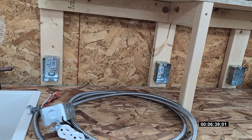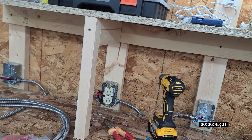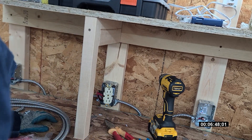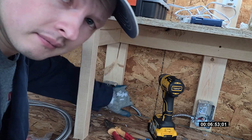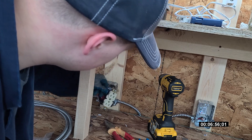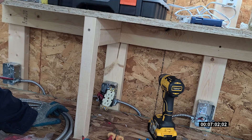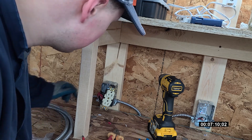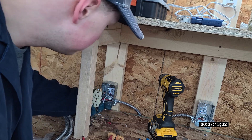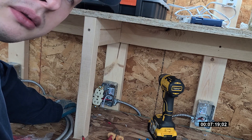So what is next? Wiring is next. We are a little bit farther into the process and this 10-gauge wire is very stiff — not very flexible. I don't think it will be possible to put this plug into that box. So we're going to go to 14-gauge wire instead.